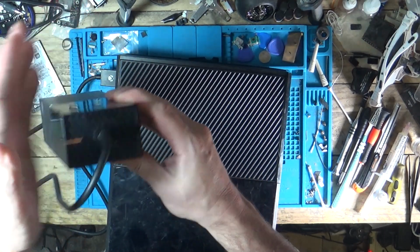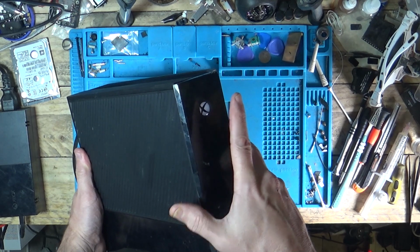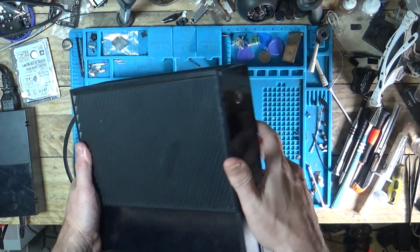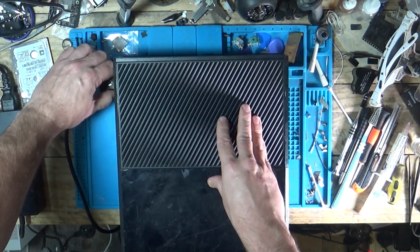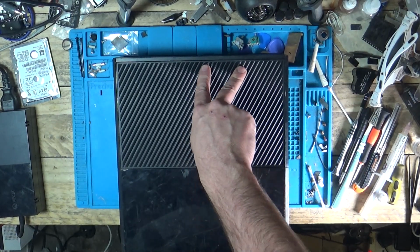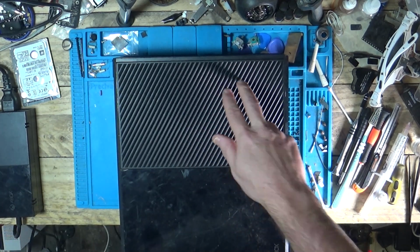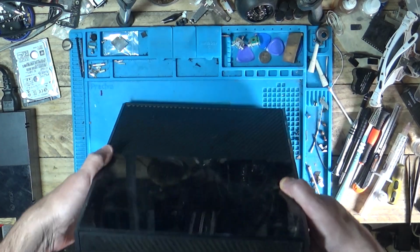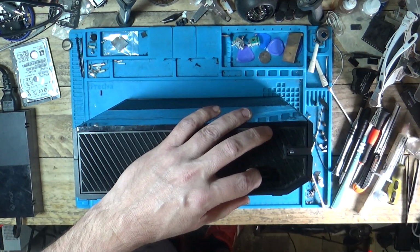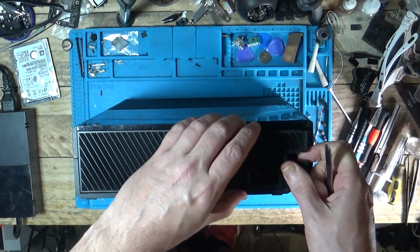Now that is kind of already telling you there's a failure in the power supply. If we try and turn this one on, it's on and straight off. Now I think when you have them straight on, straight off, it should be fixable. I think it is to do with the power MOSFETs or the power regulators that are sort of under the fan. So let's quickly get this one apart and see if we can get this one fixed. I shall fast forward this to save you the boredom again, because there's millions of videos of taking these apart.